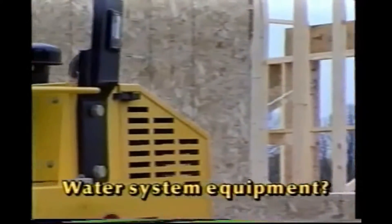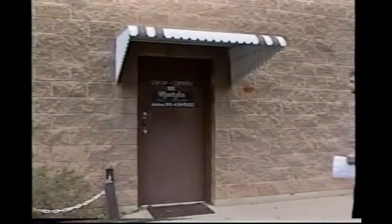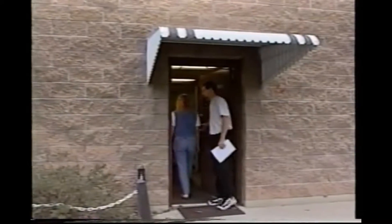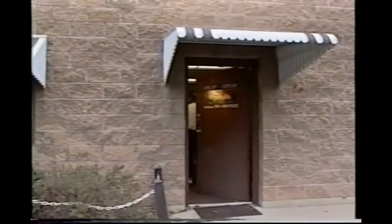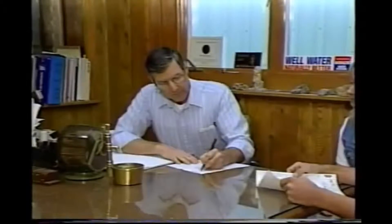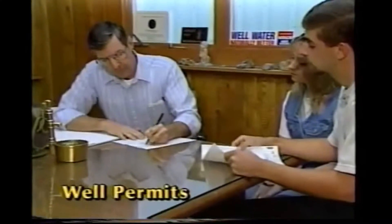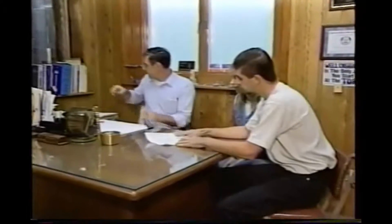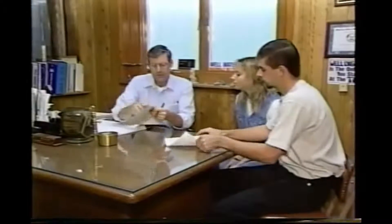The builder or homeowner should get expert advice about the availability and reliability of local groundwater and the safest place for drilling before the first dirt is disturbed. This is the time most prospective well owners turn to experts. The drilling contractor will have current information on any state and local environmental restrictions and permits required for drilling, as well as mandatory construction standards for water wells. The driller can recommend the best place for a well based on the character of the soil and bedrock and the required distance from other structures or possible sources of contamination.